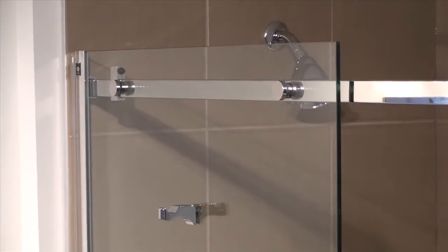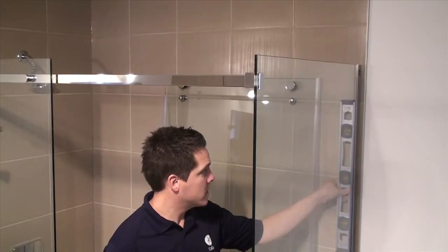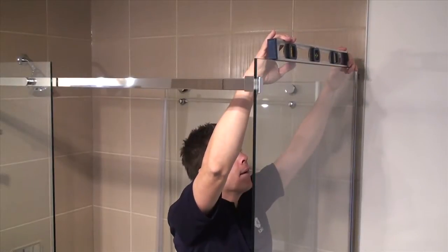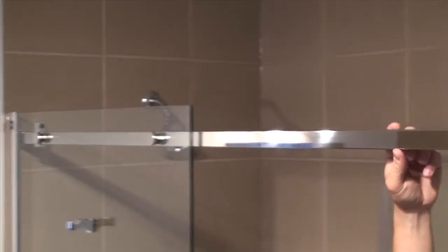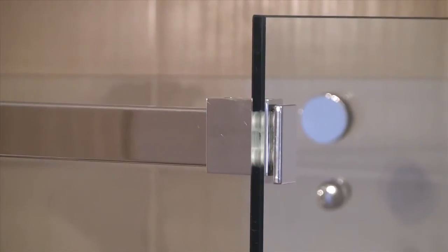The third thing to check is the shower rail. The pre-drilled holes in the fixed panel should allow you to level the rail. For more adjustment, make sure that the return panel is level — you will level the return panel the same way you level your fixed panel. For an alcove installation, use the internal wall anchor bushing by using one of the 3 holes.